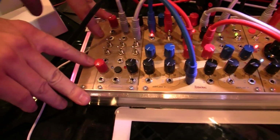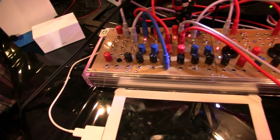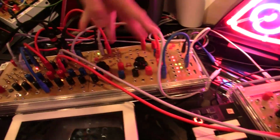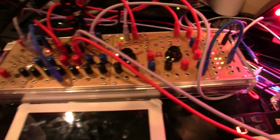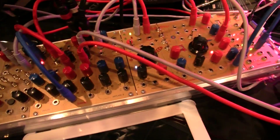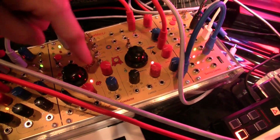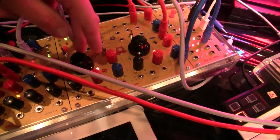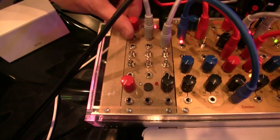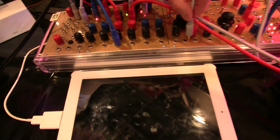And there are some VCO drivers. I call them VCO drivers because they allow you to mix the CV especially for oscillators, like when using the terminal as an oscillator, or you can use any other oscillator. It can mix the CV, and it has a special auto-tune feature, so you can have the same tuners as you had in the first generator. The tuners duplicate the functionality of being lower or higher than a certain A note, which is a multiple of 440 Hertz. And with just one knob you can surf through the whole range of the oscillator.